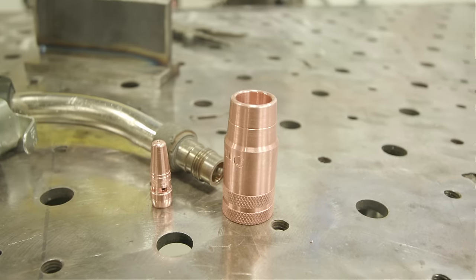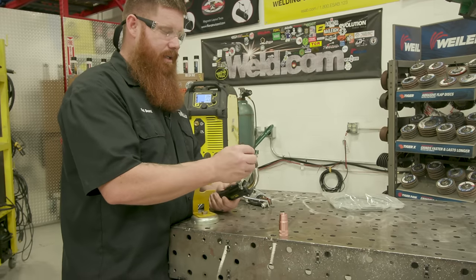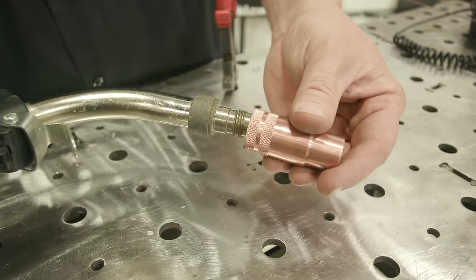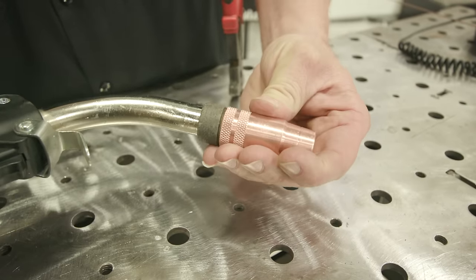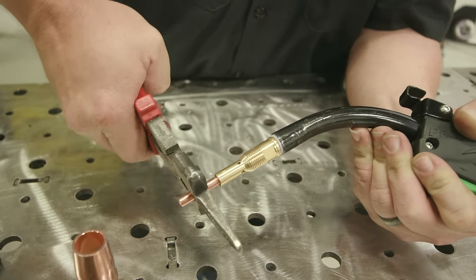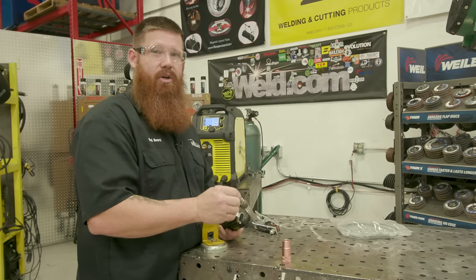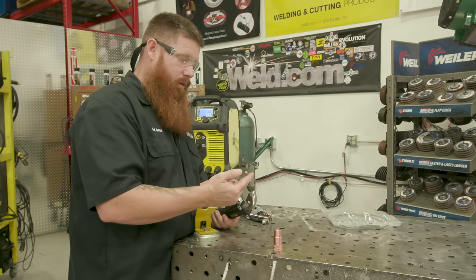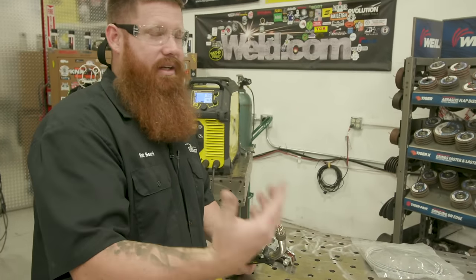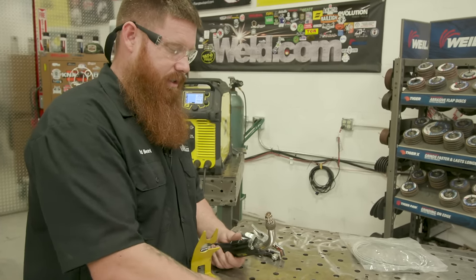At the end of the gun you have a nozzle — its primary function is to direct gas into the weld area. Next is the contact tip, which on this model has a built-in diffuser that sits inside the nozzle. Other models have a separate diffuser with a contact tip that threads into it. Make sure the contact tip is snugged down with MIG pliers — this is where the wire gets all of its energy. Running without a contact tip, or with one not sized for your wire diameter, will give you varying amperages. A secure, tight connection gives you the most constant voltage and best amperage.